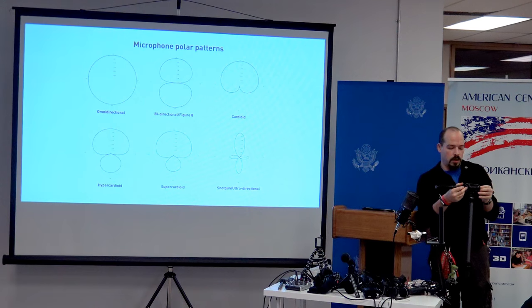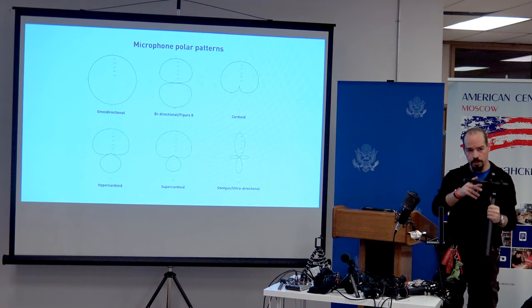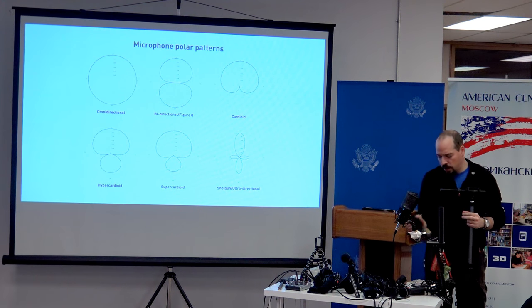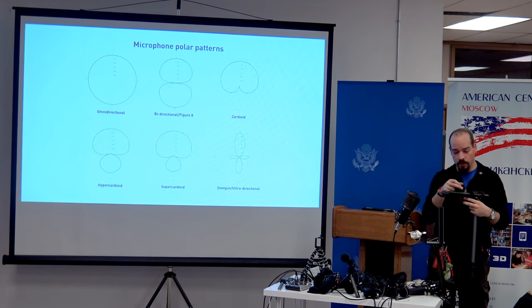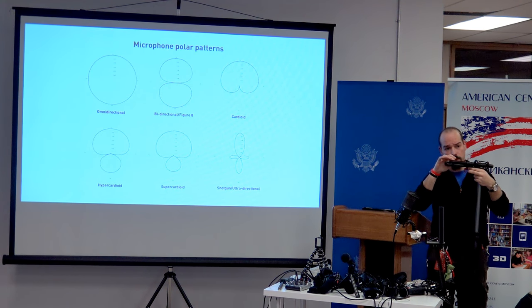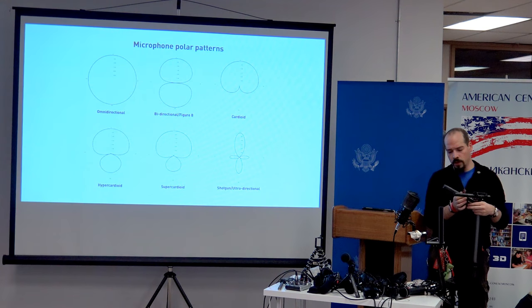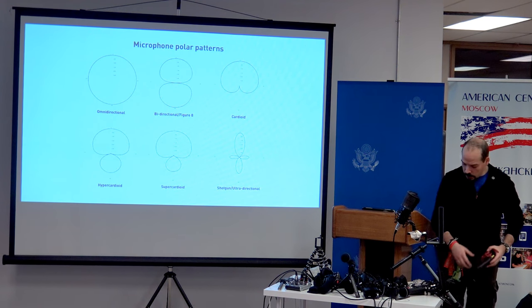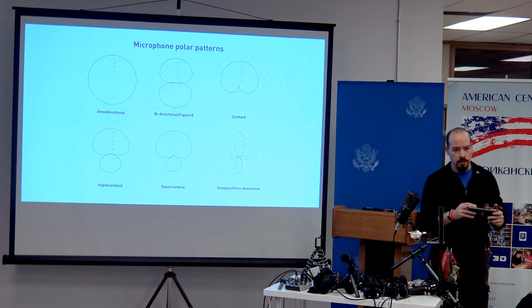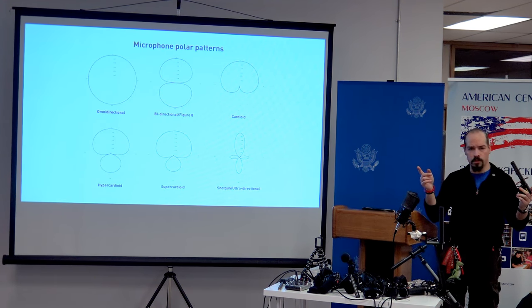One very important thing for directional microphones is this. It's like a resonance chamber. A hypercardioid microphone capsule is placed somewhere here in the beginning, and these cuts here are designed more or less purposefully and specifically. So the longer the thing is, the more cuts, generally. The lower frequencies will be picked up from the sides. For example, a directional microphone for cinematography, quite a long one, like half a meter, almost 2 feet.